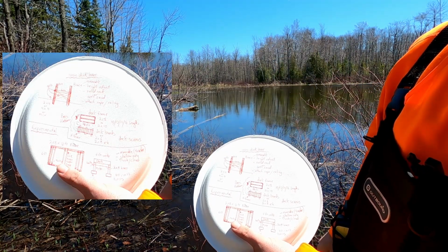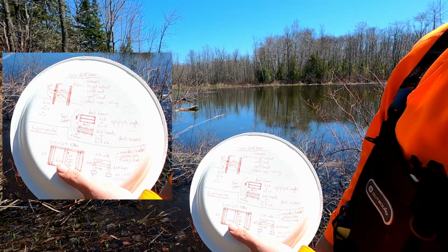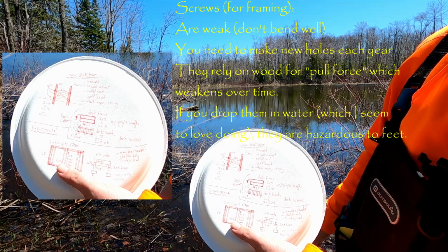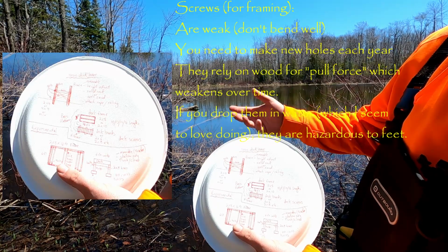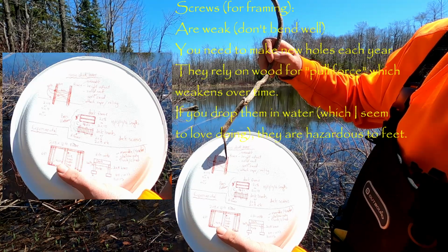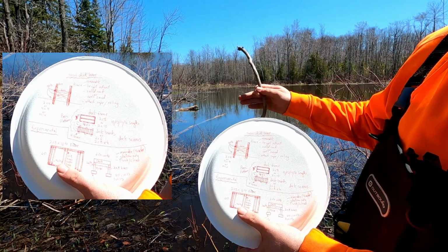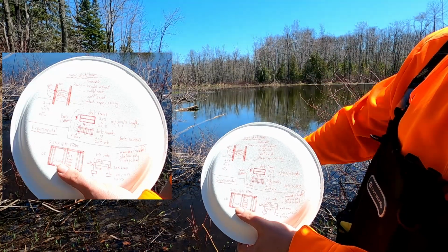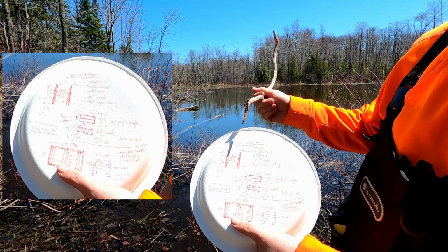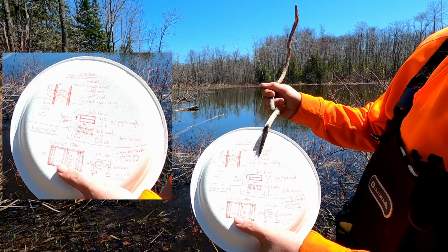Don't use screws. The first year you put it in, and then you have to take it out, you realize screws were a waste of time because they just leave holes that you don't want to reuse the next year. But bolts, you can, and it's much, much stronger. Anyway, so this is your traditional H-frame, and on top, this is where the dock would go. Standard marina in this area would be 3 feet wide. It's like a sidewalk. So you'd have basically a sidewalk going out, and the sides would be 2x8s, and the topping could be a 2x6, 2x8, whatever you've got around for the topping.